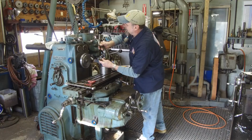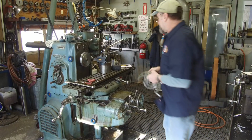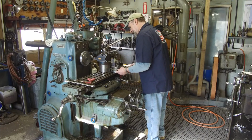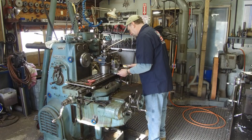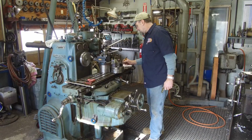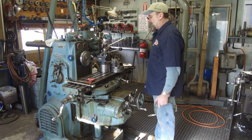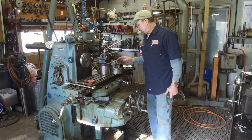Alright, and we're right around 687 and a half, and our chuck outside diameter, they say a 6-inch chuck, but I want to duplicate this outside here. Okay, we're looking at 300 OD. Alright, so we do have about 300 and X amount that's got to come off of there. So we got safely 150 a side plus maybe a few. So we're going to go ahead and swap out our insert right now.